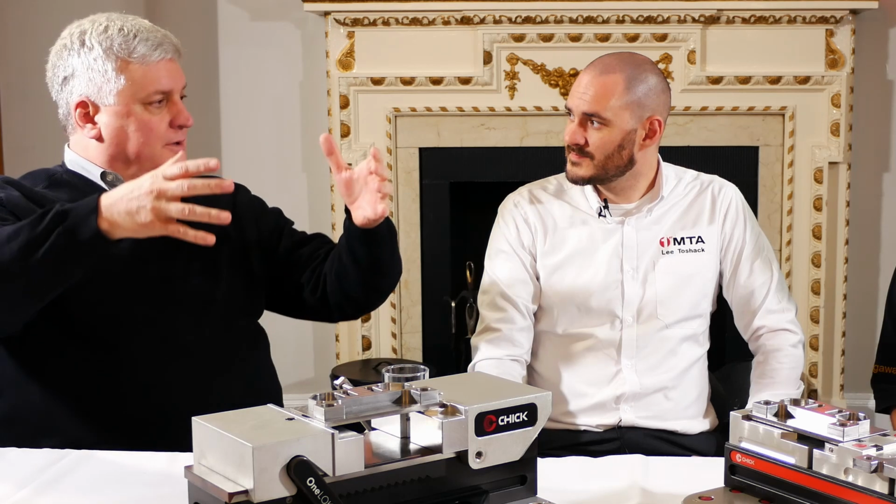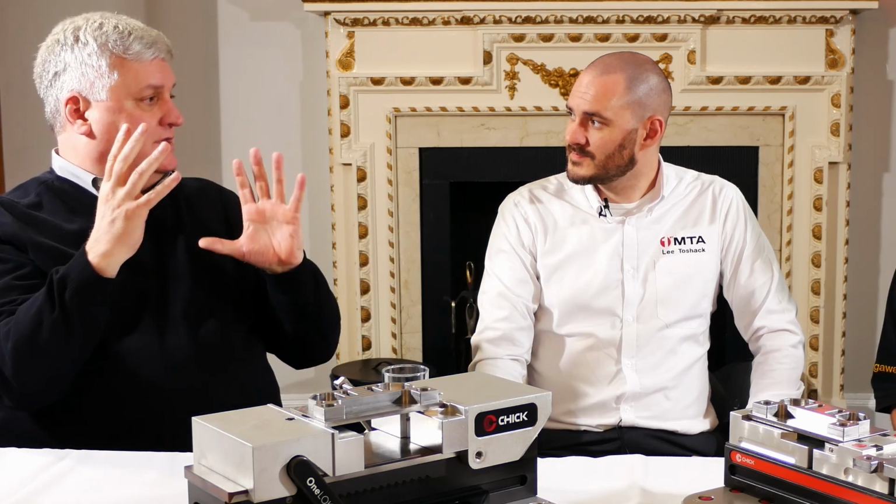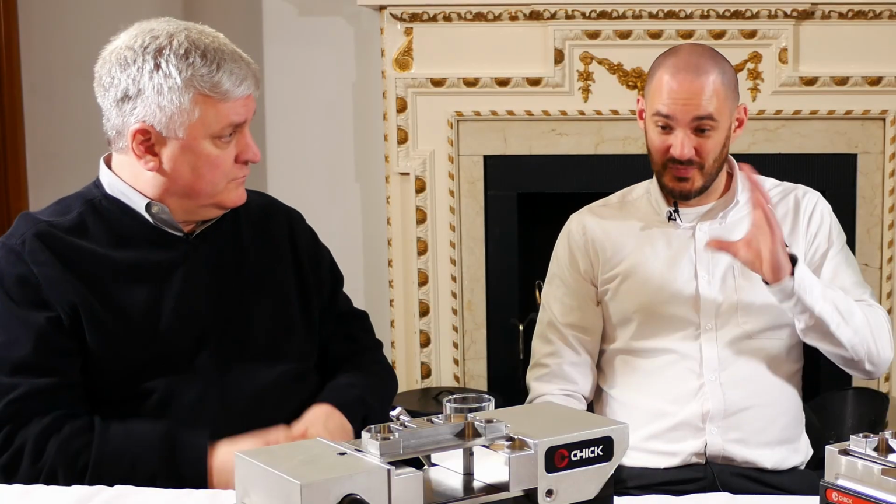We've taken it and flipped it up on its end and put 4 of them back to back. You could see how that would look like a tombstone. Okay, we have a single piece of aluminum extrusion that has all 4 sides with the same interface to it. So it's not bolted onto a column, it's actually built in. Exactly. And so the benefit with that is that it's much more compact. It's also very solid. And as I tighten it up, it actually becomes more rigid as an overall unit. Really? Okay. Yeah. So that was my thinking.